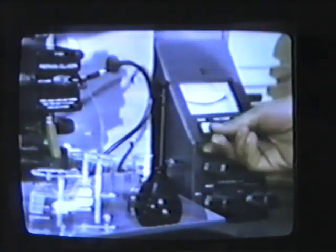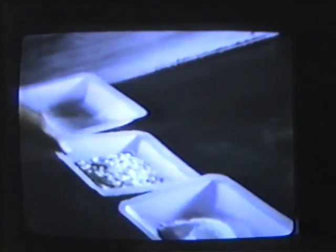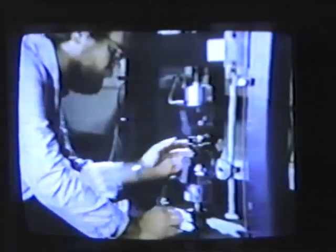Before any materials are ever sent to stock mixing, samples have been checked in the analytical laboratory. Here, a test batch of newly received rubber is mixed on a laboratory mill with sulfur, accelerators, and other vulcanizing and reinforcing chemicals. After it is molded into laboratory slabs and cured in a heated press, the rubber is checked for tensile strength, elongation, and other physical properties.